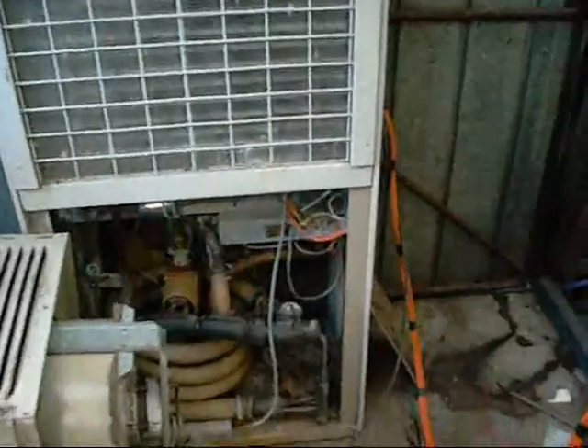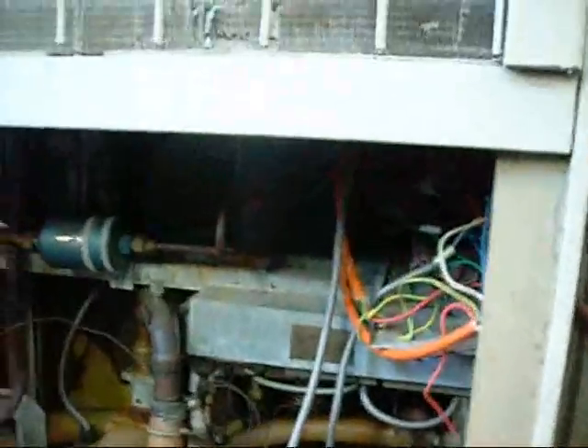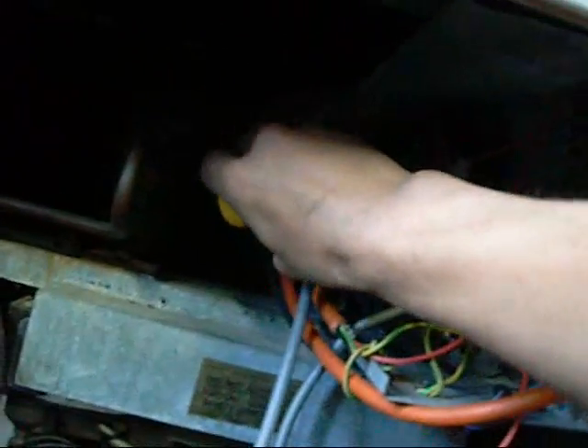Definitely pump working and water in the system. Why isn't that fan working? Let's redo that connection. The fans only work when the compressor's running, so I might change that so they continue running after I turn the compressor off. But for now let's just poke this compressor contactor — there we are, now it's working.